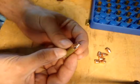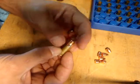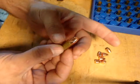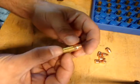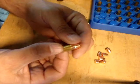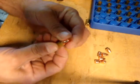Now you don't want to under flare, because then it could peel the jacket off, and you don't want to over flare, because then that's a lot more case that you're stretching out. The more you stretch these cases out, they're not going to last as long, so you're not going to get as many reloads out of them.